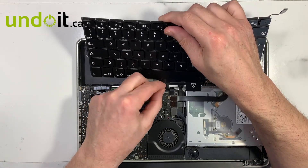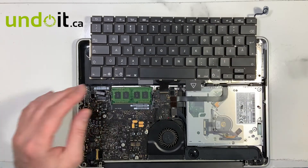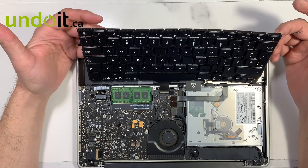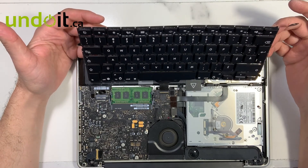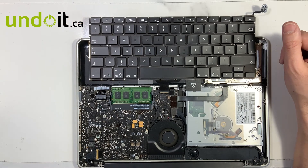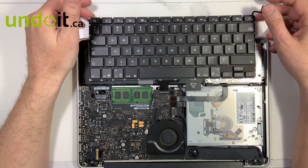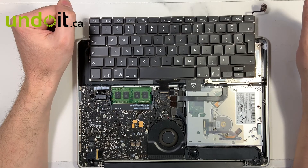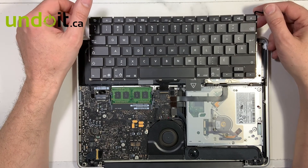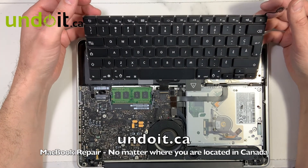So let's plug in the replacement keyboard here — there you go. I'm going to plug in the battery, test the power button — and here you go, it's turning on. So realistically, all we have to do on this one is replace the keyboard. There are other videos on how to replace keyboards on the 13-inch A1278 if you need guidance. The keyboard replacement is pretty much the same for the A1278 from 2009 all the way to 2012.